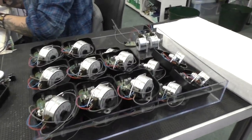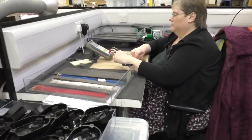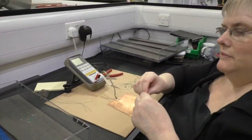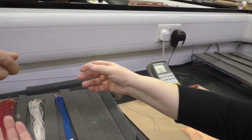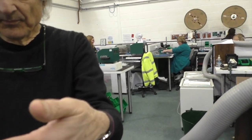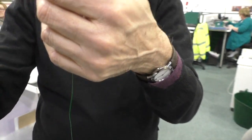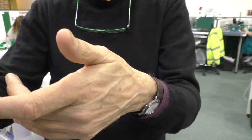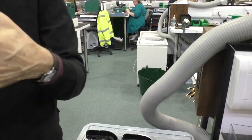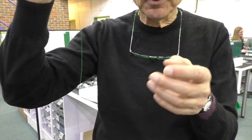Okay, so this is a whole stack of them. And next over here, she's doing the same thing, arm wiring. She's testing for continuity. That's one of the criteria we look for: flexibility. Sure, because it's going to go inside the arm. You've got 5 of those inside the arm. That adds 10 milligrams to the bearing friction at best.